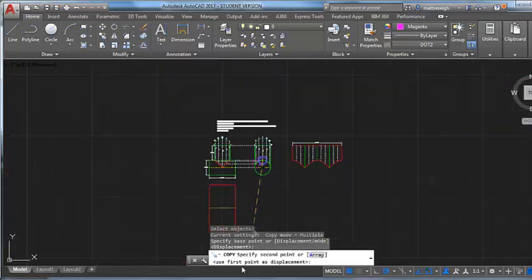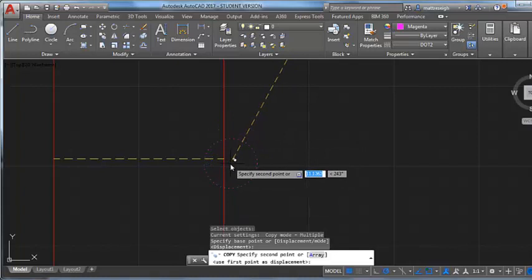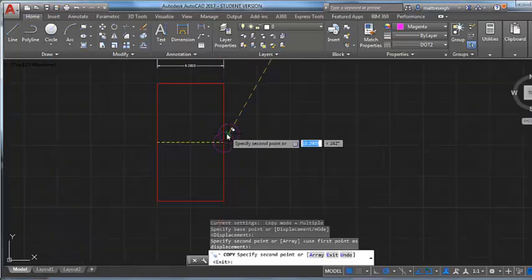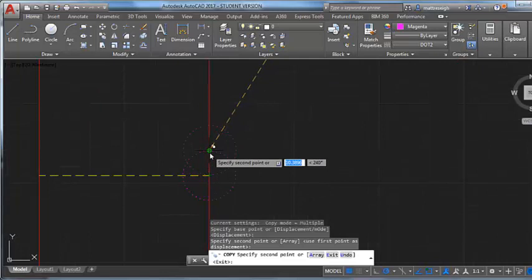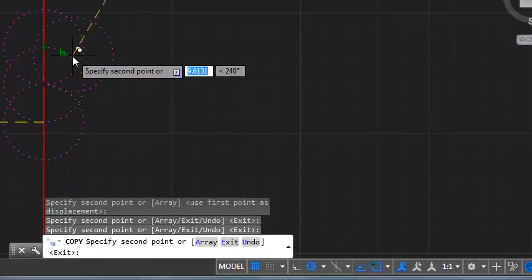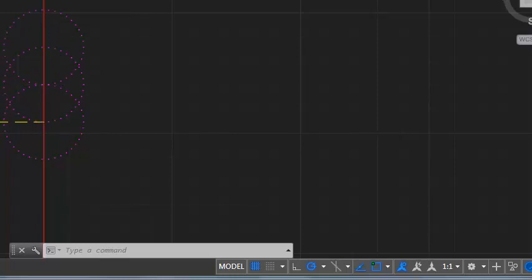I assume what I could do down here is divide this with equal spacings, and then have a true spot to put the information. But we're going to do this in other drawings, so I just thought I would do it here too. That's planting that radius distance on my header pattern, and then it's really just a matter of counting how many of those I need to reach the end of my branch. 1, 2, 3 of those will put me where the branch finishes and terminates on the header. So what I'm looking for is 3 radiuses. That's 1 radius, then if I snap another one right here, that's 2 radiuses, and the third snap puts 3 radiuses of information, and that's where the end of my branch pattern should be.